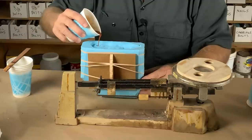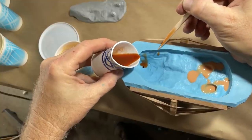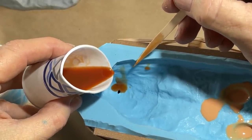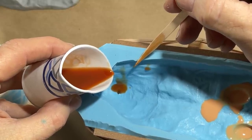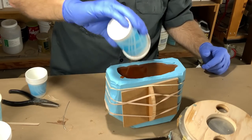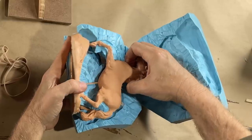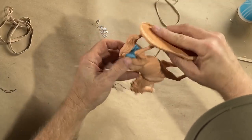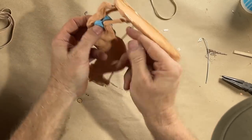I filled the mold through the back legs and that poured out just fine, but I trapped one of the legs — I didn't fill it all the way and blocked the entrance to the rest of the leg. So I'm trickling the resin down through the vent at the tip of that hoof, filling the rest of the cavity that way, and it actually worked out really well. All that was left was to fill the base and the casting was ready. I put each successive casting into the pressure pot — it actually went in and out of the pressure pot four times. The horse came out of the mold just fine, very clean with very light parting lines. You can see the little chunky that's trapped between the tail and the legs from making that bad cut, but it did its job perfectly and I got almost no parting lines around it in that area. Very little cleanup — I was pleased with that.